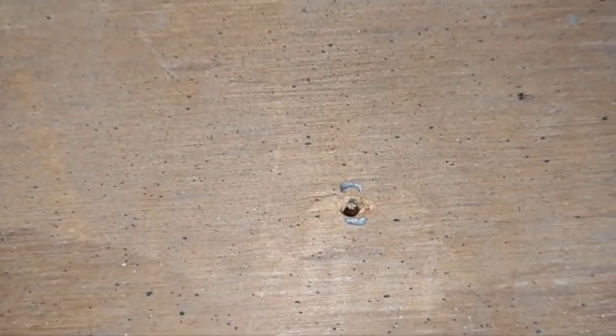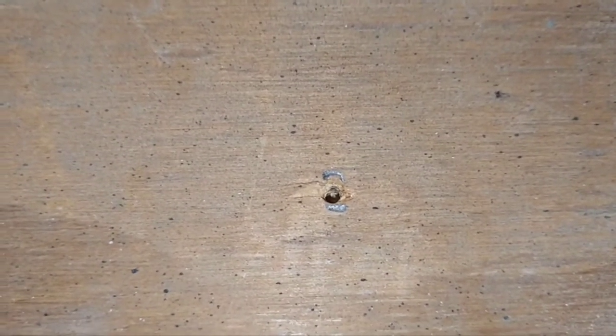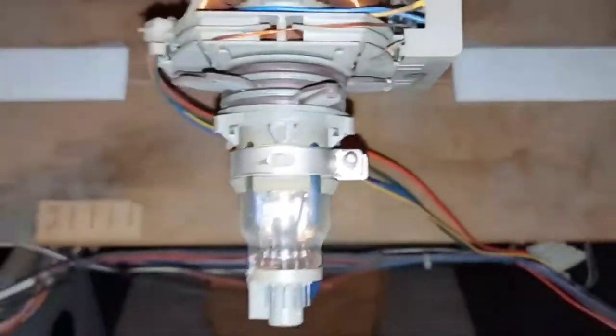Okay guys, I did go ahead and make some little starter holes in here. I had marks where the holes need to be for the mounting points on the chassis — one down there and one up there. It was a little hard to get because of the CRT in the way. I have discharged this, but I was still a little nervous getting close to it with the housing of my drill. I started to run one without a pilot hole and it started to chip out kind of bad, so I used the drill to make starter holes and ran the vacuum cleaner while doing it to avoid splinters in the cabinet.